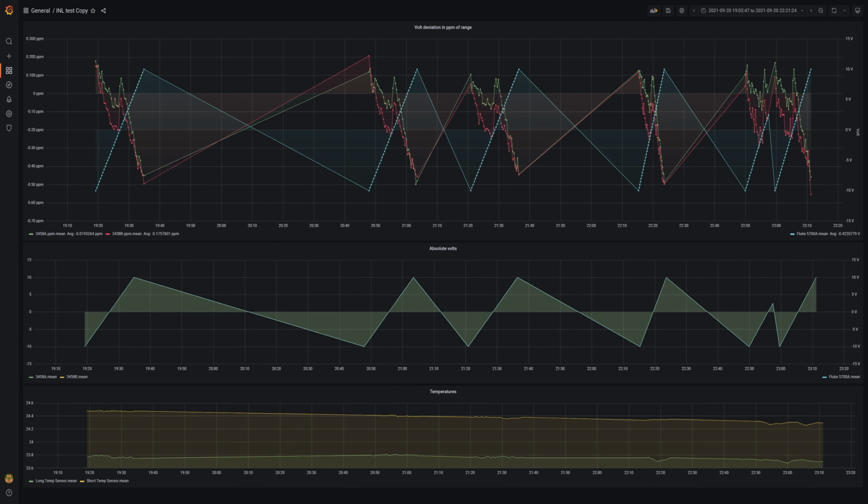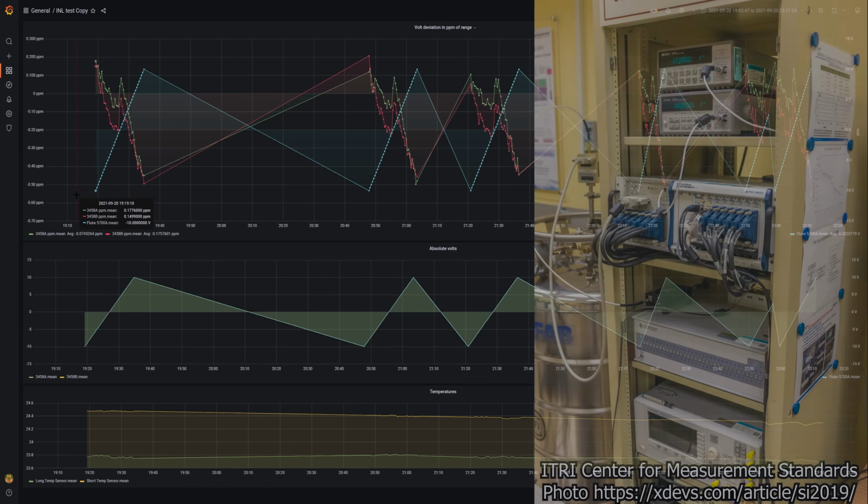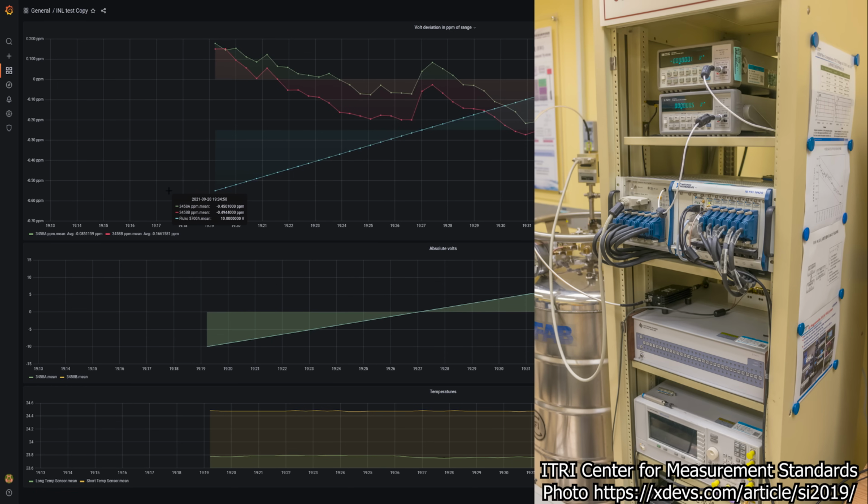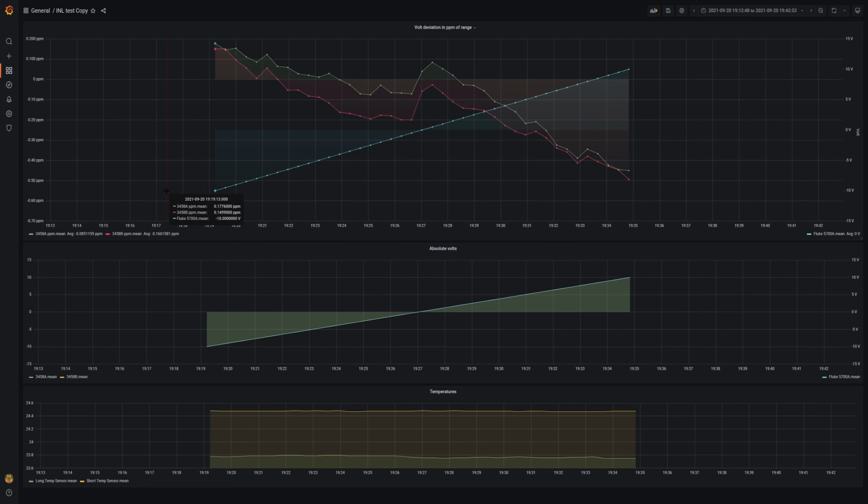These multimeters are so exquisitely linear that what we measured here is actually the performance of my calibrator, a very linear voltage source on any other day. To verify my 3458As, I would need a few $100,000 programmable Josephson voltage source to generate a range of test voltages and see how far away my 3458A measurements are. Here I did it with a Fluke calibrator anyway.